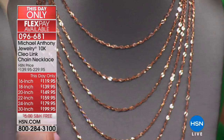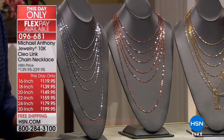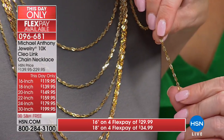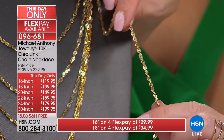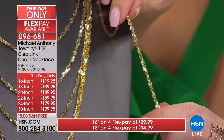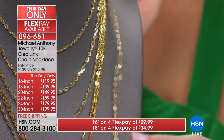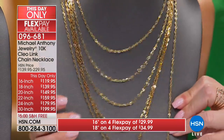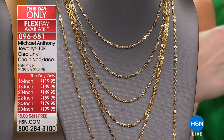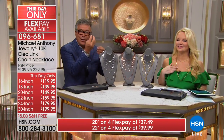It has the helix, and I wanted to show everyone the flexibility and the difference, because it's not a rope. You'll see these individual little — it's almost like mirrors or plates of gold. They are plates, actually — it's not a wire, it's a flat plate. The machine that weaves these was actually created just to make this chain. There's no soldering here; they're actually laser welded together in the assembly process. You make a very shiny plate of gold, then stamp out little horseshoes, and that makes the continuous weave of the chain.